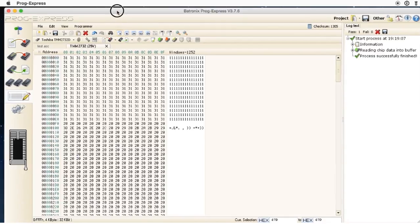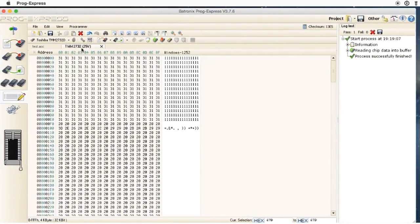Obviously your results will vary. This particular chip is a TMM2732, a Toshiba part. A different chip might react differently — might be worse, might be better. Where you are in the world, how much UV is around, what time of year it is, the cloud cover — that kind of stuff all matters. But this took five days. I wanted to show that yes, it can get erased by ambient light. The same thing would happen if it was sitting on a shelf — it's still going to get data corruption, it would just take longer. Not years, certainly, but months. So there you go — that dispels the myth that it doesn't actually happen. Yes, it does happen. Have a good one, catch you later, remember to subscribe.